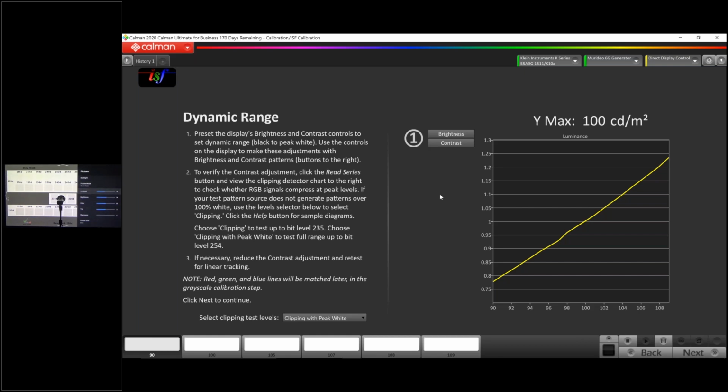So right now the contrast is at 43. I believe it was 50 from the factory. I don't want to push the reset button and wipe out everything in case that is what it was, but regardless of where it was from the factory, I still need to turn it down a little bit. So I'm going to take the contrast control, and I'm going to watch those first 4 boxes with my eyes, and I'm going to see if the yellowish greenish kind of tint goes away.